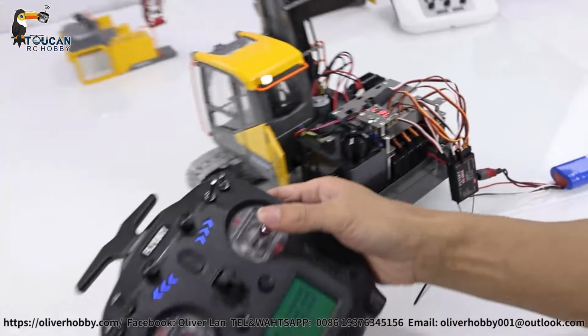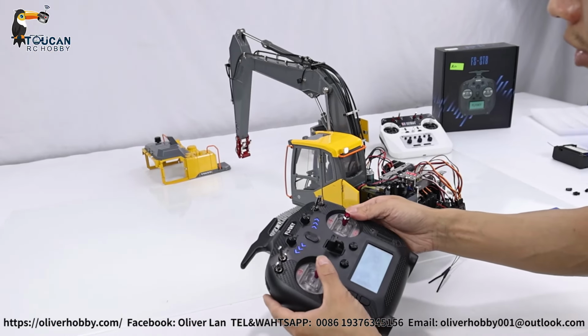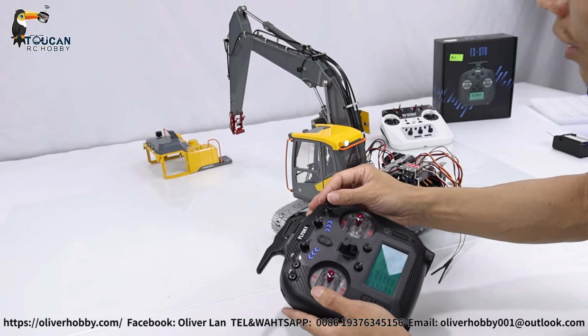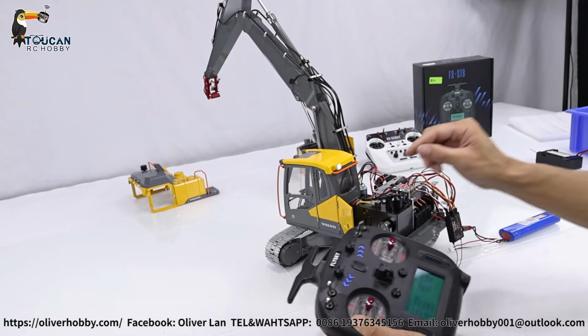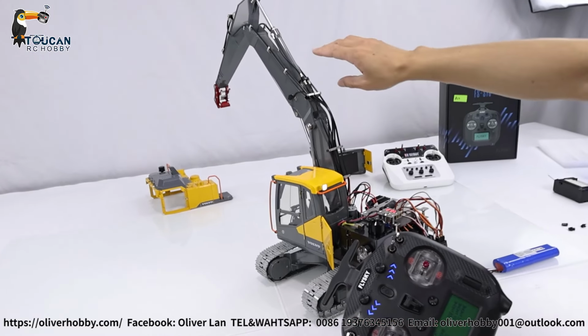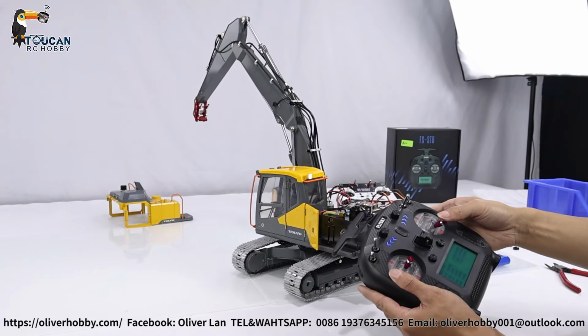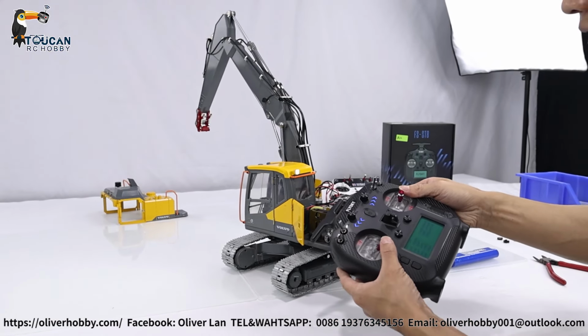Test to see, big arm, okay. Front arm, good. Middle arm, okay. So later we only need to change it a little bit for each arm. For the operation, direction needs to reverse to be correct. Now, front arm is not correct. We reverse it for channel three.